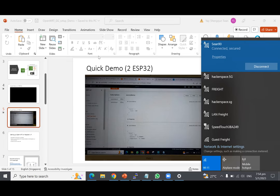Yeah, but eventually, in one of the commercial applications I'm doing, I'm using a Greengrass enabled gateway as well, and I actually have to make XML requests to the controller that I'm attaching my Raspberry Pi to. So that's where the Greengrass function can come in handy, because I can put a lambda function on the Greengrass itself and then it goes to the Raspberry Pi. Okay.